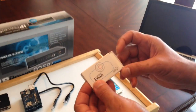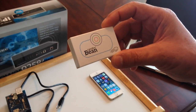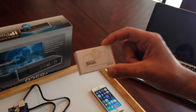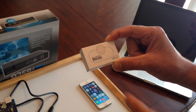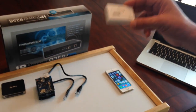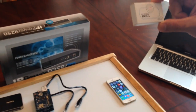We bought a new device that came to the market — they call it the Light Blue Bean. This device is battery operated with 3.3 volts, though you can use your own power supply. The nice thing about it is it's similar to the Arduino — you can use the same code you have for Arduino on it. On the same board, there's a little chip for Bluetooth so you can communicate with this board via Bluetooth without needing to go to the serial port. It also has an accelerometer, a temperature sensor, and other features. We wrote the program for this one and loaded it inside one of these and put it in the vehicle.